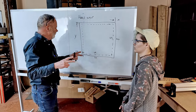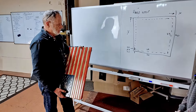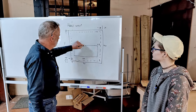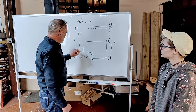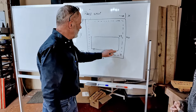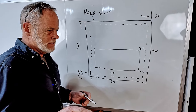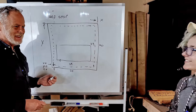You'll get emails or phone calls from people saying they keep getting error 2 and don't understand why. Here's why — let's say they're running a huge American flag that's 28 inches, and they have a half-inch margin before the soft limits. If they started their zero point off to the side such that the flag runs past the soft limits, when they start the G-code they'll get an alarm saying the code is telling the machine to go outside the soft limits.